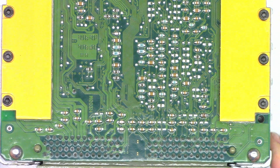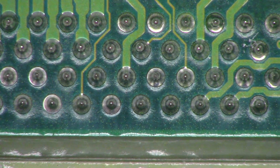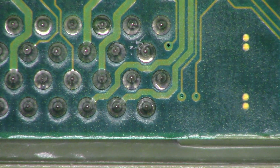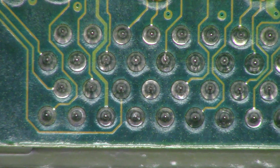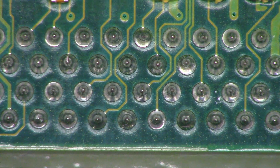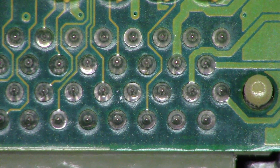Let's zoom in on all the connectors — I think there's 104 pins on this thing. Everything looks excellent, not seeing any problems with any of the pins. All the solder looks really good. Looking straight down on it, I don't see any issues with any of the plate-throughs, no pins that were forgotten or missed at the factory. I'm sure these things are wave soldered.